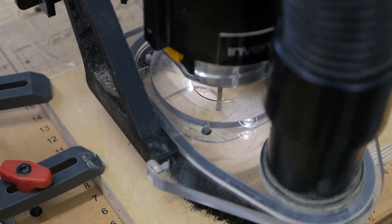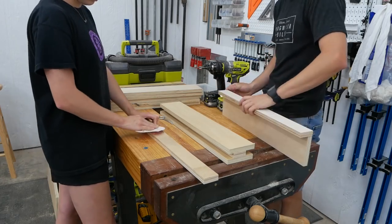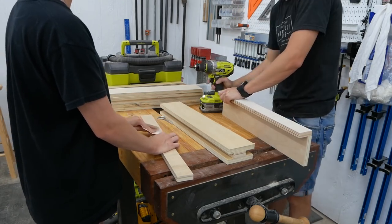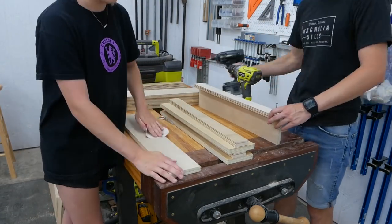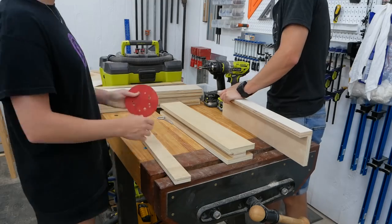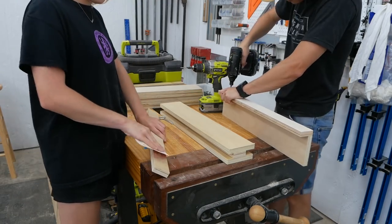While the coffee shop's name gets carved, we are sanding the logo and putting together all the shelves. The shelves are pretty simple. We are just using scrap 3/4 inch plywood and attaching a strip to the back of them so we can screw them to the wall. The screws will eventually get covered up by the shop's coffee bags.